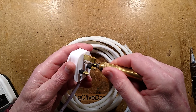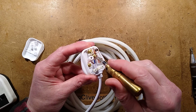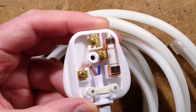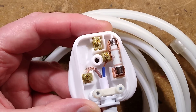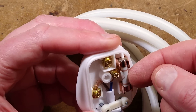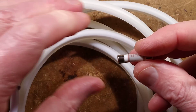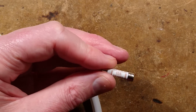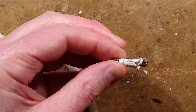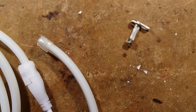Let's start with the plug and see how they put a fuse in it. They've got the blue going to live — badly terminated. Look at that, that is just dire. That's not how you terminate a plug in the UK — that is pretty bad. The blue and the brown are in the wrong terminals, which doesn't really match, though I suppose for an ungrounded item. The fuse here is also not been terminated very well — it's very strandy. Now this fuse, if it's a real fuse, should have sand in it. Let's crack it open — no, there's no sand in it. So it's a non-compliant fuse and non-compliant wiring of the plug.